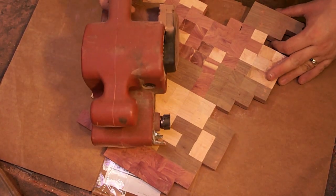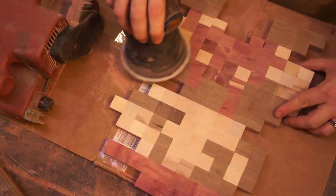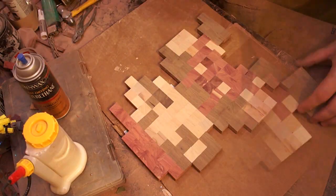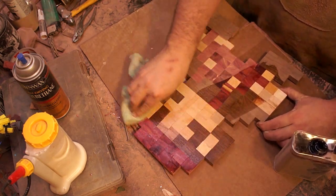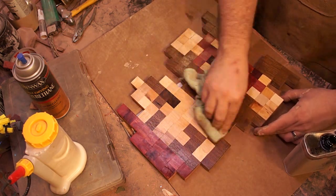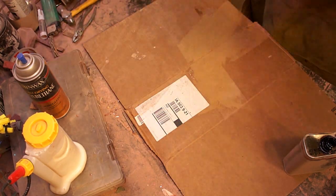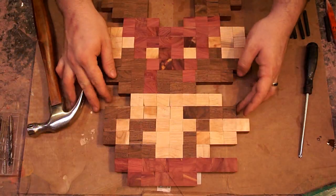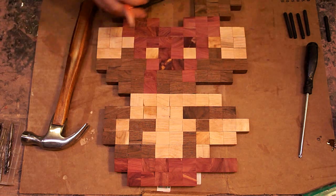The only part left to do here is just a lot of sanding. I ended up using boards that weren't quite exactly the same thickness — I didn't think it was going to be that big of an issue, but being an eighth off was actually quite a bit to get sanded down. I edited out quite a bit of sanding on this video. I've been doing a lot of rub-on poly with my recent projects and I did that with this one too. I found a new brand — this one is Minwax High Gloss. You get a glossier finish depending on how many coats you use, and you can really build up the finishes to make it super shiny, or leave it a little bit more matte like I did with this one.